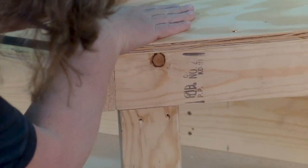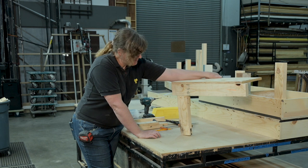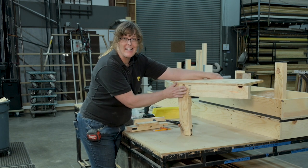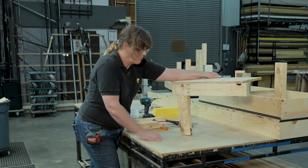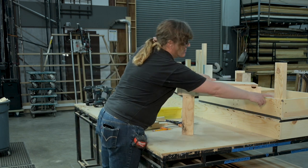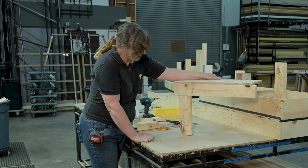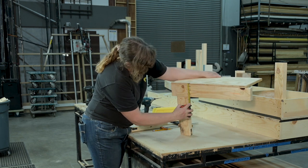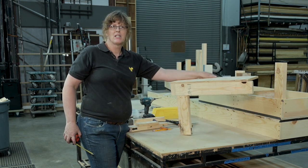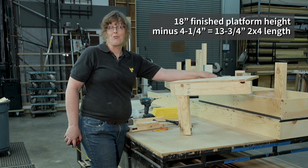I'm standing on here — the weight's going through that three-quarter inch plywood, through the framing, and straight down into this leg. That is actually a very, very strong joint. Once it gets cross bracing and everything else, also look at this — it puts it flush with the outside. That's going to make facing a whole lot easier. I put my cross bracing on the inside and I've already got my flush surface to face things. You can also do the math: if this is 2x4, we've got four and a quarter inches, so we just need to subtract four and a quarter inches from whatever our height is. If we need 18 inches, we're going to cut four and a quarter inches off, so that's 13 and three-quarters of an inch.